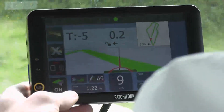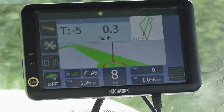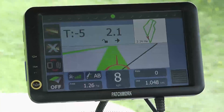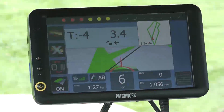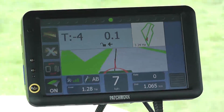As we come into the headland work we can turn the coverage area off here to stop the area recording. Then if we do our turn in the headland, as we get close to the next line it will appear ready to turn onto. If we just get lined up and then drive out of the headland and put the coverage area on again, then follow the line to the other end of the field.